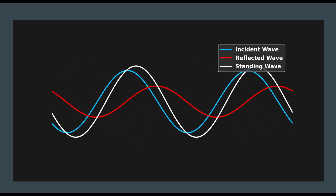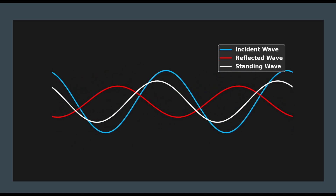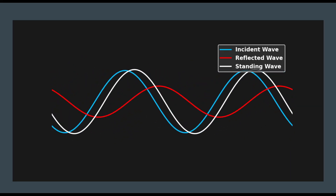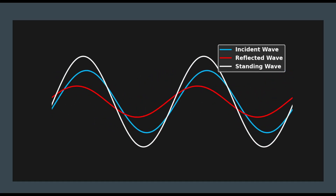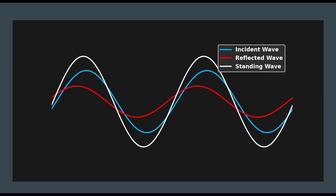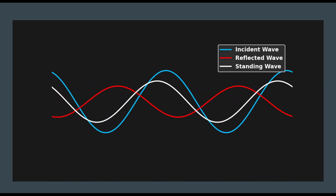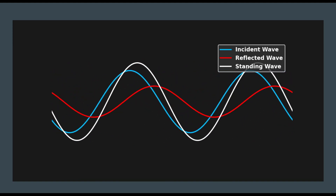When this happens, you do have two traveling waves, and you do have energy coming back into your tuner or coming back into your radio, regardless of what anybody tells you. Standing waves are called standing because they stand — they don't move, they're stationary. It makes perfect sense that our incident wave is larger than our reflected wave, because only a portion of that comes back. Even if you had 100% of your transmitted signal coming back, they would be the same size.